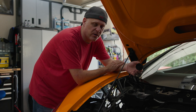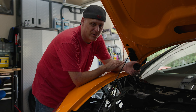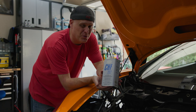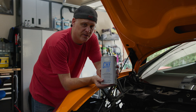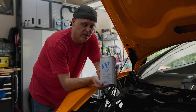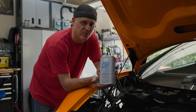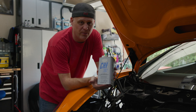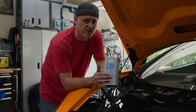We're going to be very careful, cover this all up, make sure none of it gets onto the car or onto anything in our wheel wells such as our calipers. For power steering fluid, you actually don't need much. This is Pentosin CHF 202, which is what McLaren recommends for the McLaren 650S. I literally just bought one liter on Amazon just in case. We may need a quart or half a quart, depending on how much we lose as we take off and replace the accumulators.